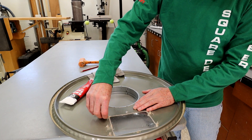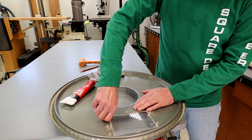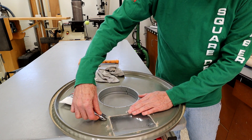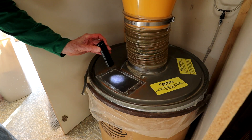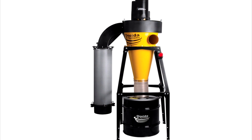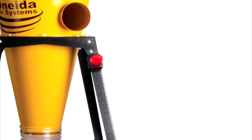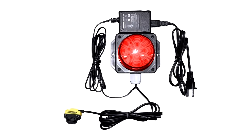I just cut a hole in the sheet metal with a jigsaw, and then added a small piece of glass attached with a bead of silicone and a few screws. Shine a flashlight into the window and you can see exactly what's going on inside. If you purchase a V3000 system today, it comes with an infrared sensor that tells you when to dump the chips. I haven't seen it in action, but there are several comments on the website where people seem a bit disappointed with it.